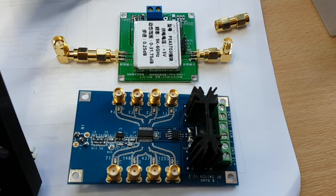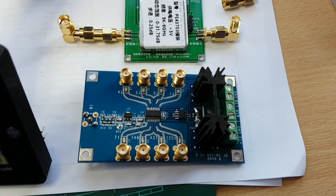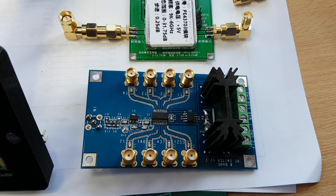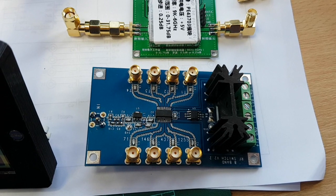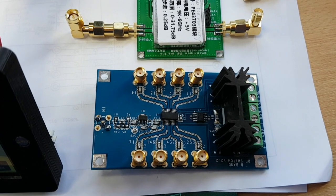These two are the remaining RF parts: a programmable attenuator that I've modified per the wiki, with the solder blob changes, and the 8-band RF switch, which is quite challenging, and that's up to date with changes from CQTV 262. I'm putting those details on the wiki page for this device.